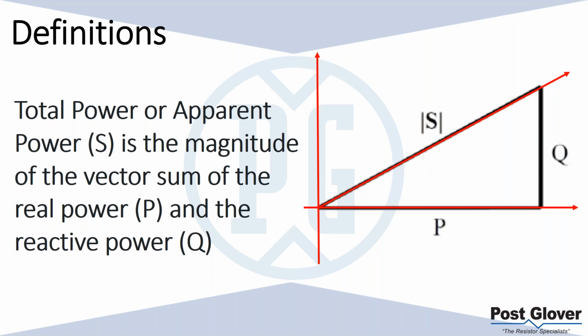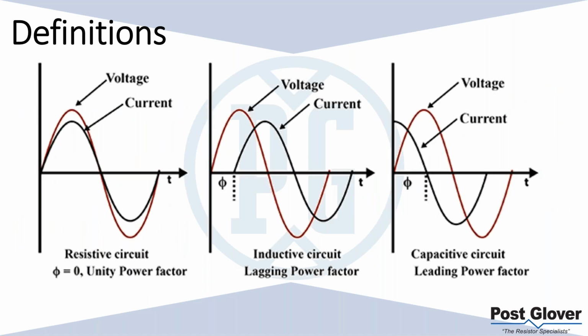Your overall power is called your apparent power. And so you have real power, which is P, and then your reactive power, which is Q. If you take the vector sum and overall magnitude of that, it's going to be your apparent power. That's your overall power consumption. It's going to have both a real and a reactive element to that. The reason why that matters